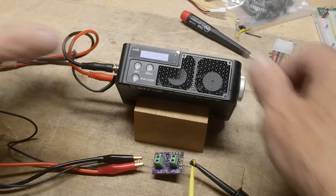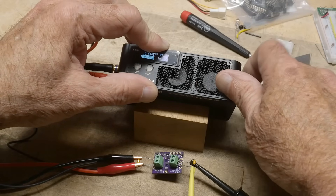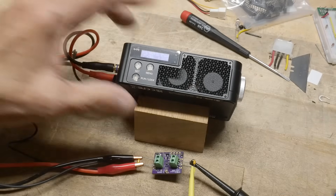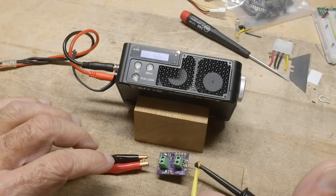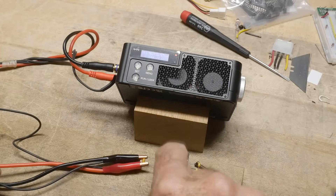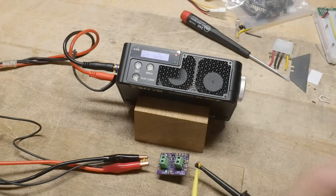Let's move it back down to 0.9 amps. I turned it on and reconnected things. I've removed the power and put it back on to reset it. There are some reset pins where you could hit it to reset, but I don't have that hooked up, so I just disconnected and reconnected power. It's now running at 10.6 Watts — so there is power going through the little chip.